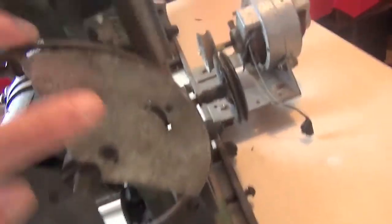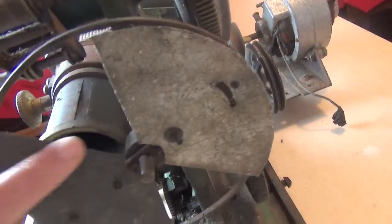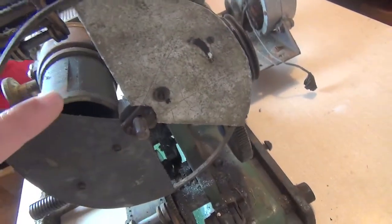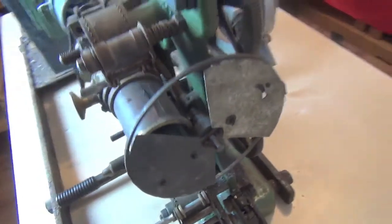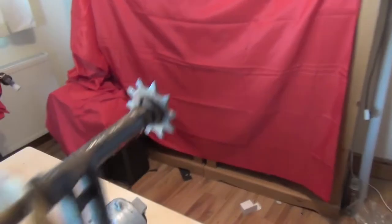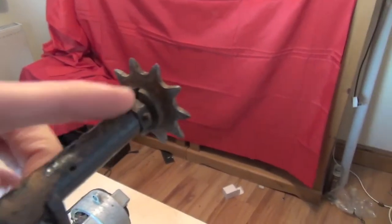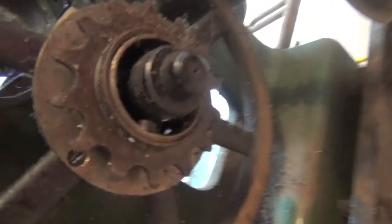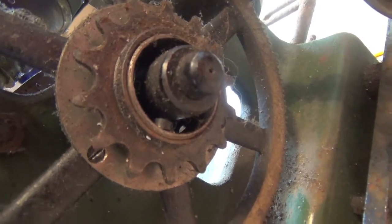Back to the shutter — there's a level of adjustment for the exact timing of the two apertures. The feed arm has a change sprocket, as does, more importantly, the take-up arm, which goes to a change sprocket there. So we're going to need a bike chain at some point.